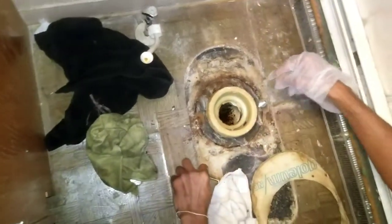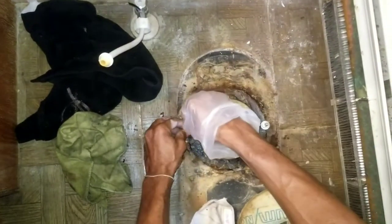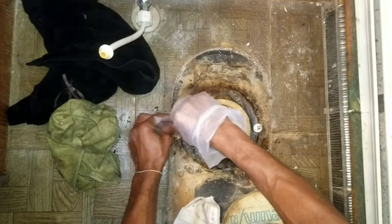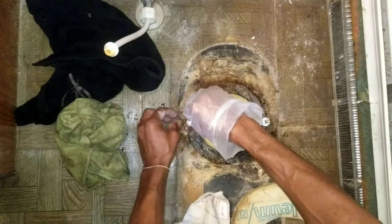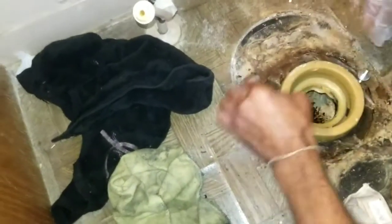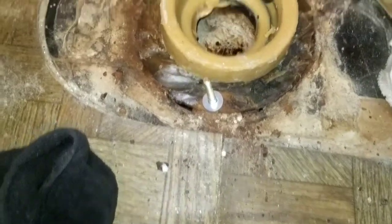Alright. So it goes down in there. This goes like this. And I think you're supposed to tighten up the sleeve ahead of time. I'm gonna tighten this up, get it tight before you put the toilet on there. Yeah, so instead of fighting with the toilet down in there, you're gonna get the sleeve and the T-bolt tight together.